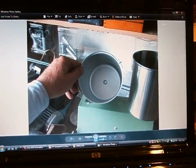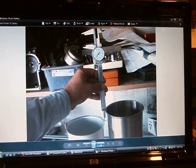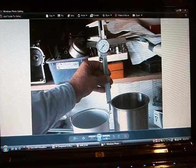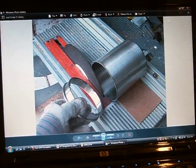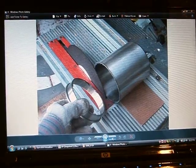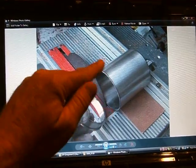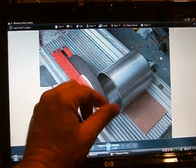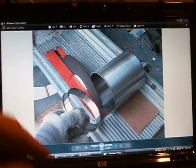Here's the original mixing bowl that came with the ice cream maker, and the new bowl happened to be about an inch longer, so I had to do some modifications to make it fit the machine. What I did — I put it on my table saw, got a metal cutting blade, and I didn't push the cylinder through. I actually rotated the cylinder just at the very edge of the blade, scored it all the way around, then pushed it through just about a quarter of an inch and slowly rotated the cylinder until the outside piece fell off.